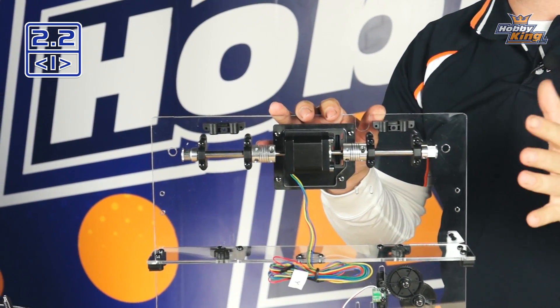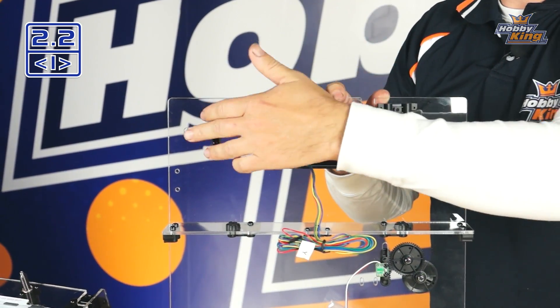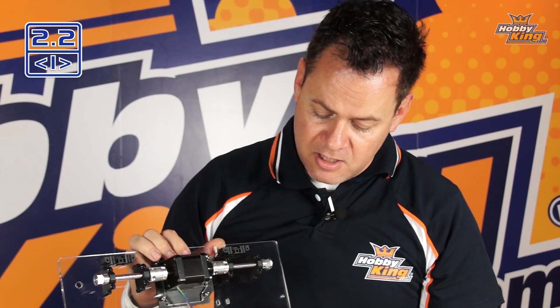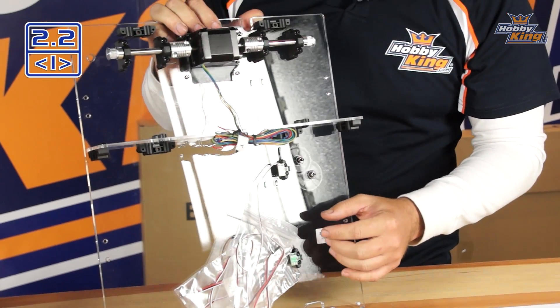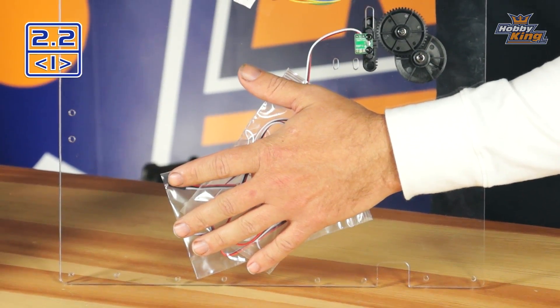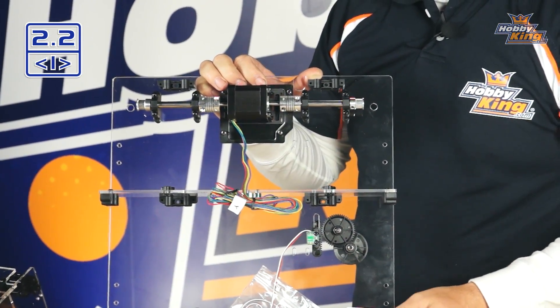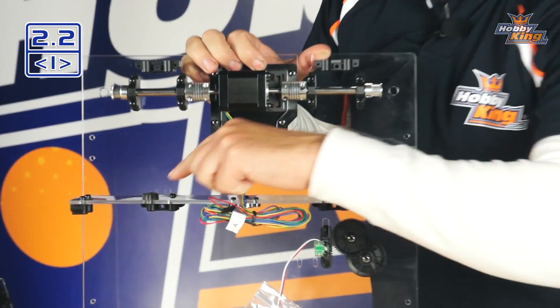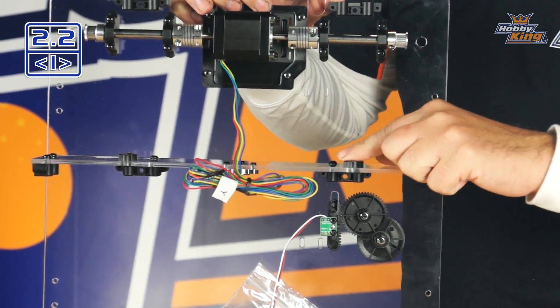When we install all the belts I'll explain why dual drive is a key important feature. We've got our stepper motor and dual belt drive for the Y axis, and also some limit homing switches. Be aware that these cables are critical — try not to damage them in this process. Right here on this cross platform are the two mount points where we'll install our rods. Screws go in from the top, and then we'll slide the platform up into those rods.